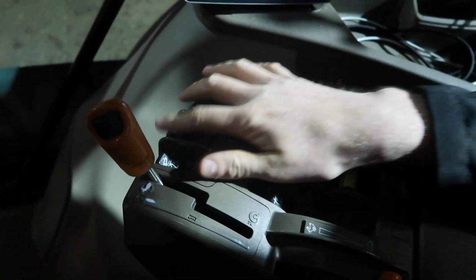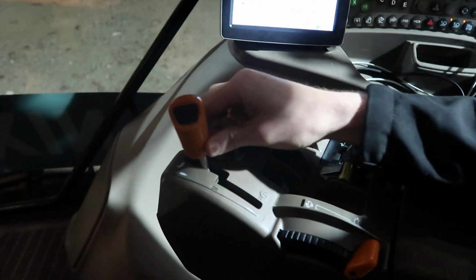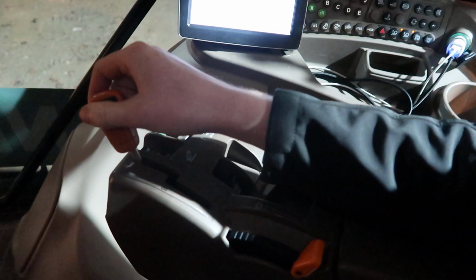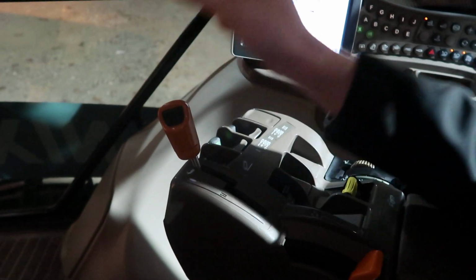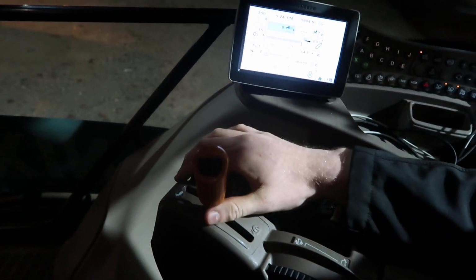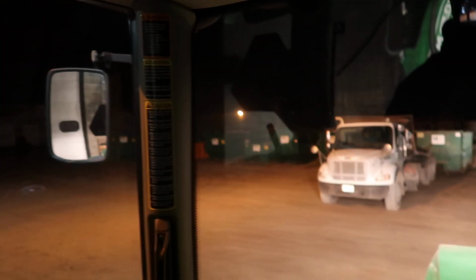And let's take it for a little rip here, but this one's a 14, so the computer's not the newest edition, but it's got all kinds of settings. Like, here is how you control your chute. So your remotes are just these little switches here, which is pretty sweet. You can control how fast or slow they go. This here is a way you can control your speed. So how I've been running it is basically max speed is your second gear there. The scroll wheel just sets your top speed all the way forward, of course, full throttle. In a driveway, it's nice, you can throw it back to sort of your in driveway speed, and then you pull up to the driveway, pull back, PTO on, and you're rocking. So super slick operation.